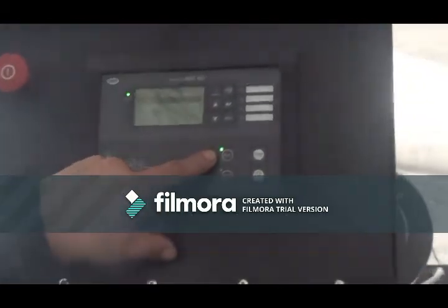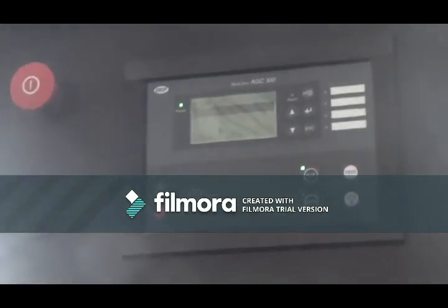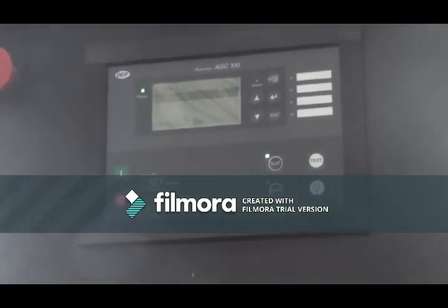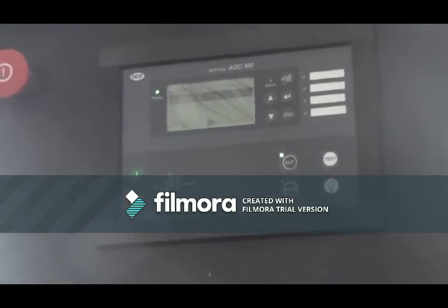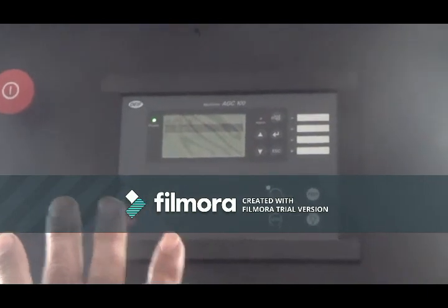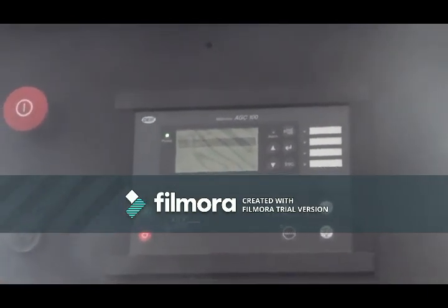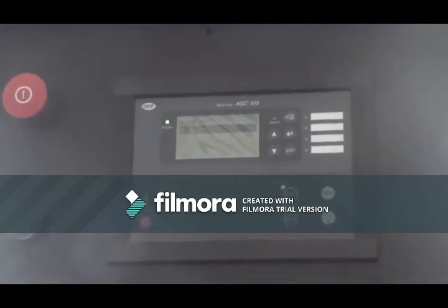We have to make sure that the generator is in automatic before we touch anything. The reason is we want to make sure that when we come in, the generator has been in the location it's supposed to be in, in case there was a power failure. So before we do any work, the first thing we have to do: are we on service right now? Is the building on test? No, I don't think so. If you can call the monitoring, because sometimes they'll call you and tell you.